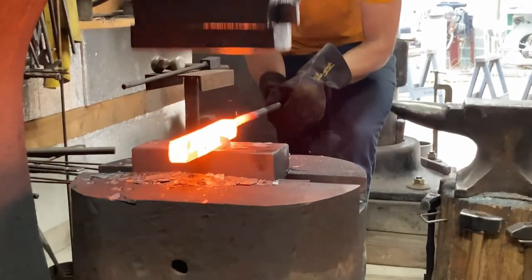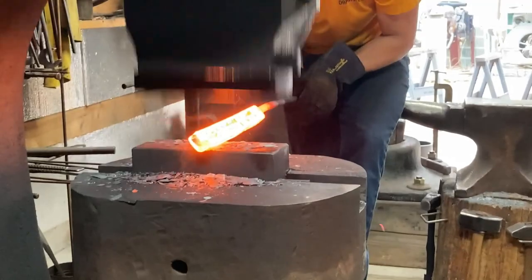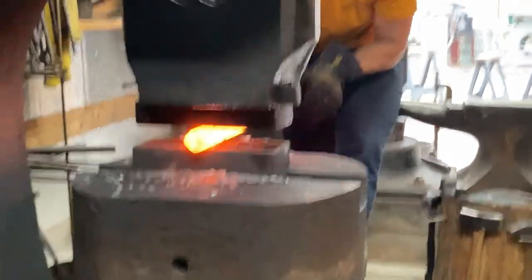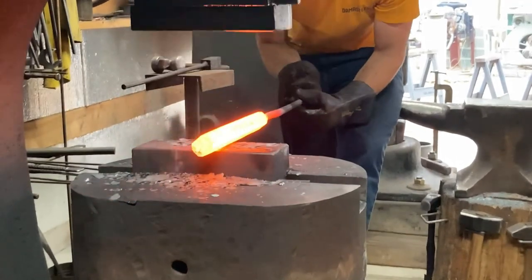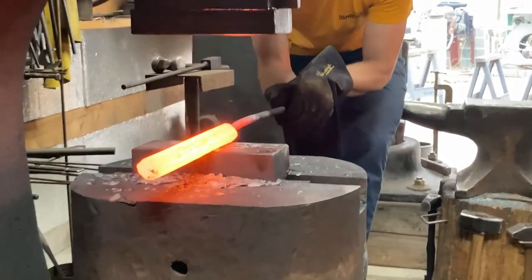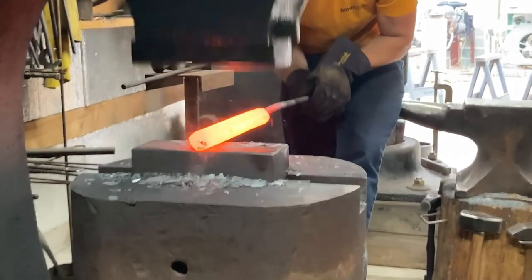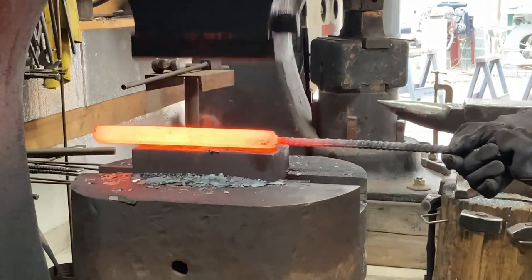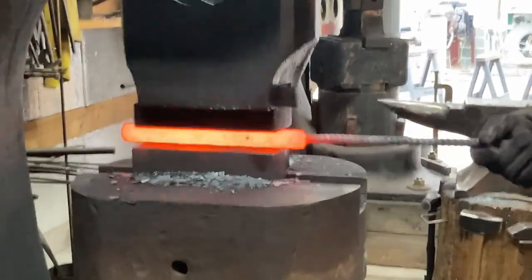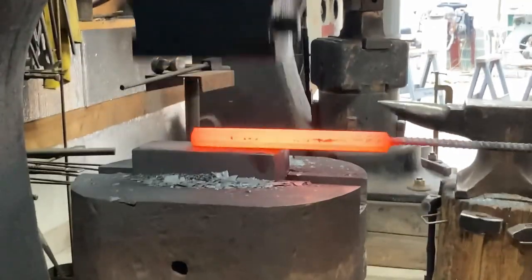With the 12 layers of W's here, I forged it out square and heavy, and now we're going right into re-squaring it. The W's are all to one side of this bar, fairly close to one side. So now I'm making it so I have exploding points rounding the corner of one side of the billet with the rest of the billet black. I'm just re-squaring it to start the beginning of a star or explosion-type element with the W's that I created. I've gotten it pretty far and I'm just finishing it up, planishing the corners square lengthwise through the dies here like normal.